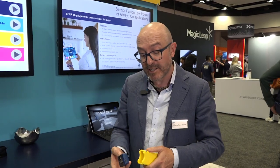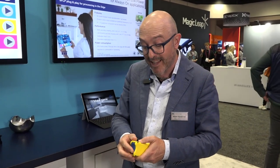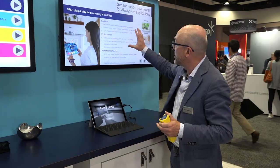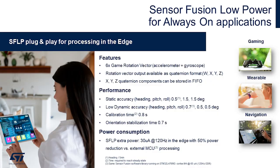We're going to use a couple of features embedded in our main six-axis IMU — a combination of accelerometer and gyro together. We put much more intelligence in respect to the previous generation. One interesting feature is Sensor Fusion Low Power. In gaming controllers you need to track your hand movement, and with the Sensor Fusion Low Power you can combine the accelerometer and gyro to track movement in 3D space in a very effective way.